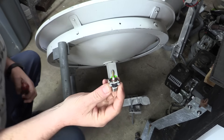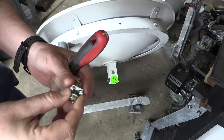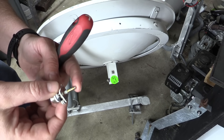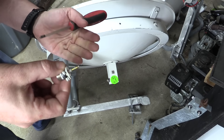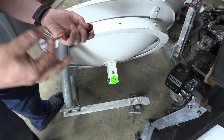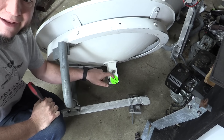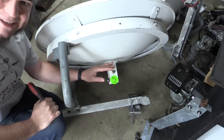If we take out the antenna connector, you'll see this is the actual antenna — everything else is basically just guiding the radio waves, and this is the electrically connected part that connects to your antenna cable. This is the entire 5 GHz active element, and the rest is just the reflector and the hollow tube or waveguide. If I want to modify this for 1.7 GHz, I'd have to make it longer because lower radio frequencies use longer radio waves, and you need a longer antenna to efficiently pick them up. The problem is a wire long enough for 1.7 GHz actually touches the other side of the metal and grounds it out, making for a poor antenna.